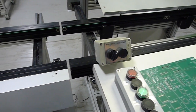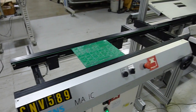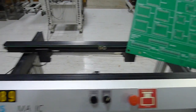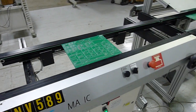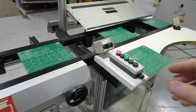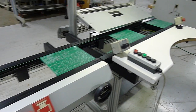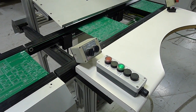We'll repeat this three more times to fill the queue. You can see it will stop there and not continue as it's backing up. We'll put the last one on. Now you'll notice the red light is out — since the queue is full, it will not be calling any more product from the previous operation.